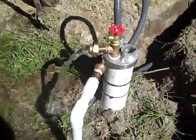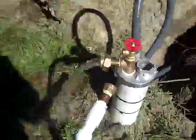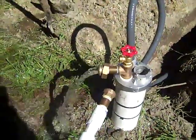Next we'll test everything, look for leaks, check everything electrically, make sure we're getting the right voltage and amperage, and record those numbers. Our goal today or tomorrow will be about 6 gallons per minute at 55 PSI. Just turned the pump on — flushing out the pump, turned the solar on — doing great. Let's put some water in the tank.